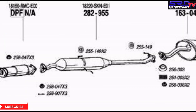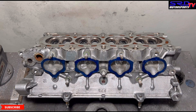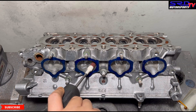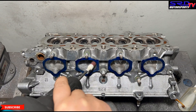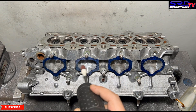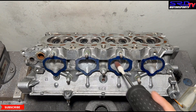Now let's head back to the porting bench. We spray an ethyl alcohol mix with soapy water because we're going to hit it with 80 grit. Now we're going to start making passes to get the carbide surface evened out. And on this certain motion that I use, it lets me feel if there are bumps or uneven surfaces.